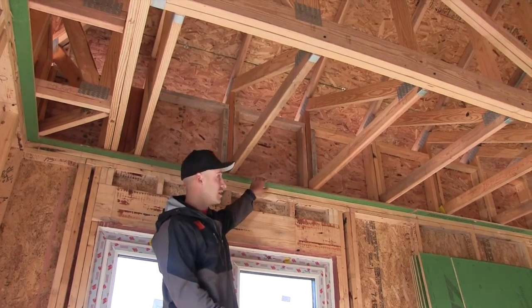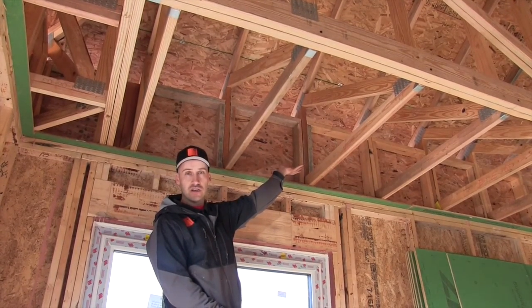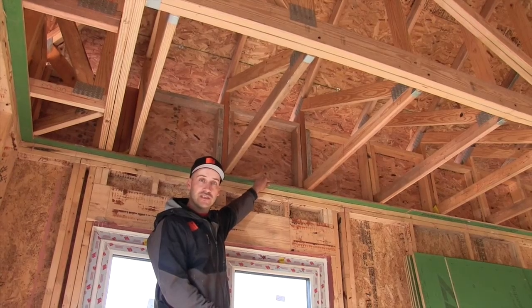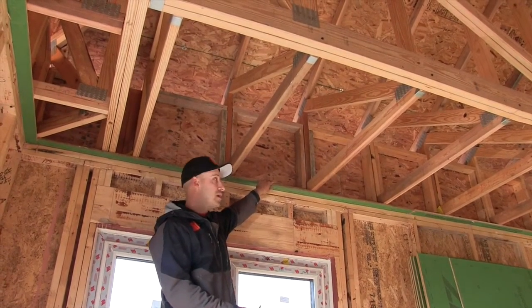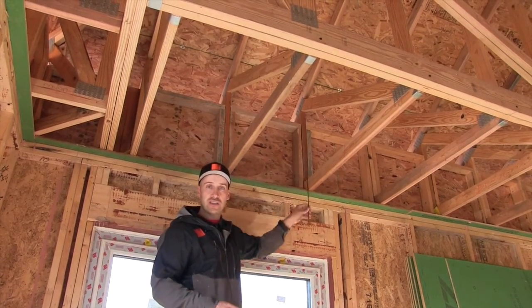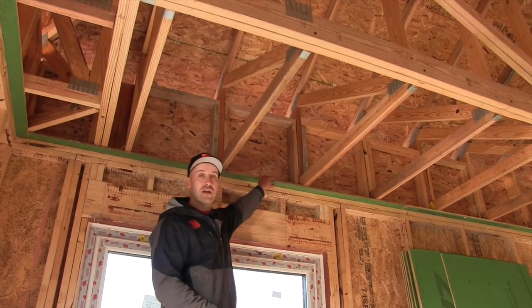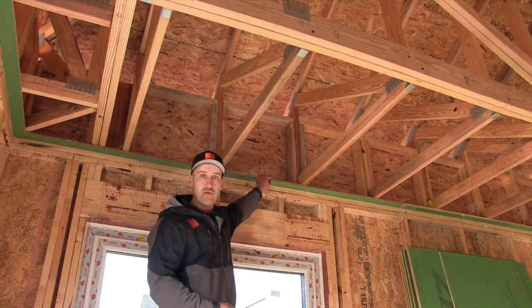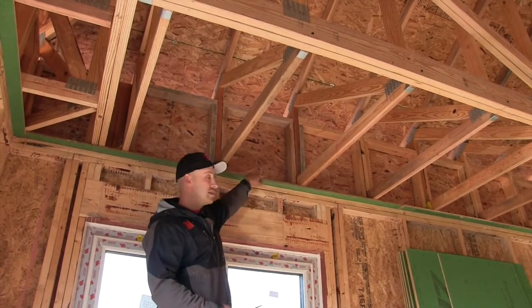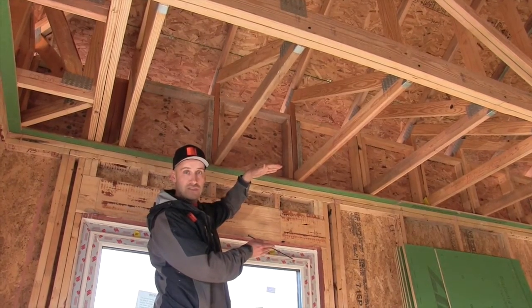The other key characteristic is that we've made our air barrier from our wall to the underside of our truss connection. We first installed a flange of sheeting before we put on our roof trusses to make this transition a lot simpler, and we're using a long screw through the top plate to the underside of our truss to make our structural connection. In standard construction, you'd be using a hurricane strap, and this would be a very time consuming process of air sealing around that strap. With this method, we're able to make a very clean transition from our wall to the underside of our truss with our air barrier, and also make our insulation layer continuously thick to the outside edge.